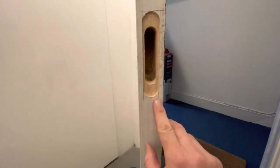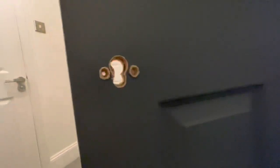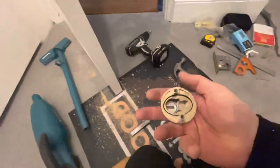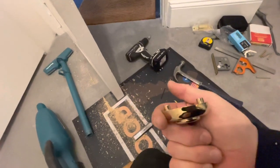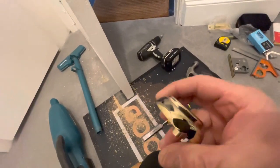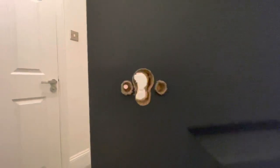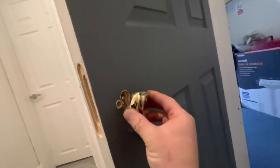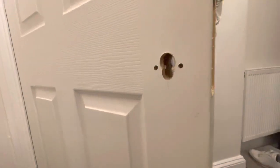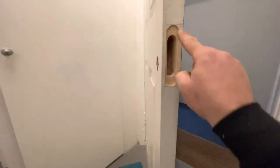So we're just going to chop out the corners of that. I've done the hole for the Euro cylinder and for the screw. On the back of this, you can see these two bits here — they're actually sinking into the door. So I had to make them a little bit bigger just for that to fit on. The back side's done as well, so we'll chop these out and get the lock in.